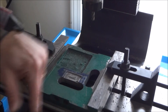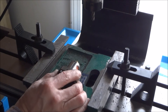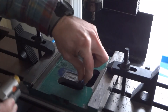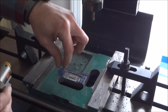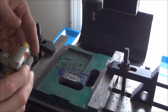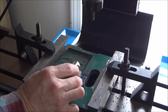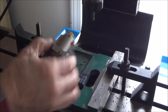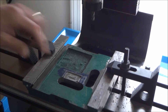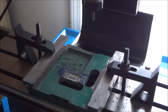I kind of wished he would have marked up the center line — I'm just having to try to guess it. The guy who provided the kit didn't really give any instructions, but he did show what measurements to leave. All these castings are different and it's hard to tell. I've definitely got clearance for all this, so I'll trim this up and then if I need to I can come back and shave a little here and there.